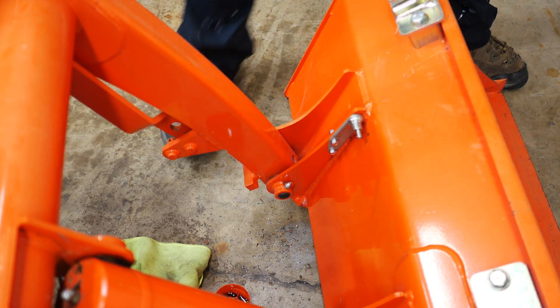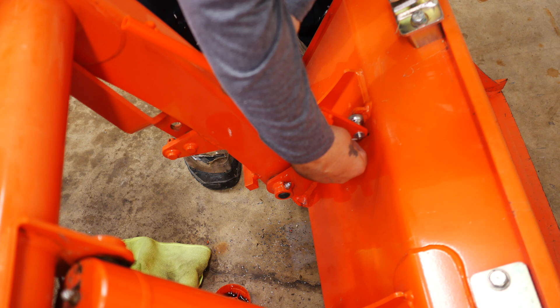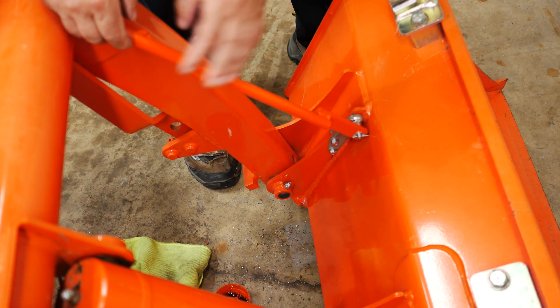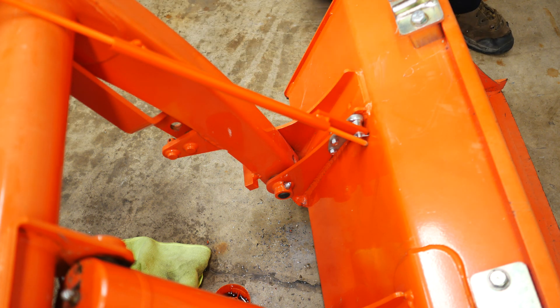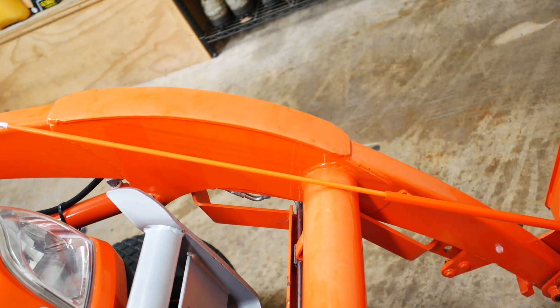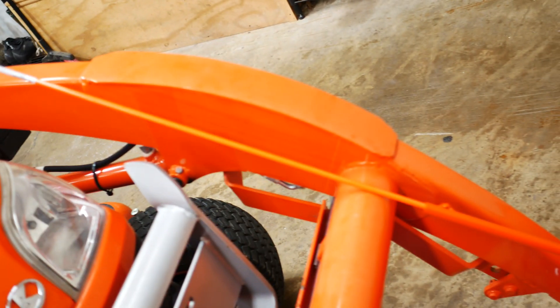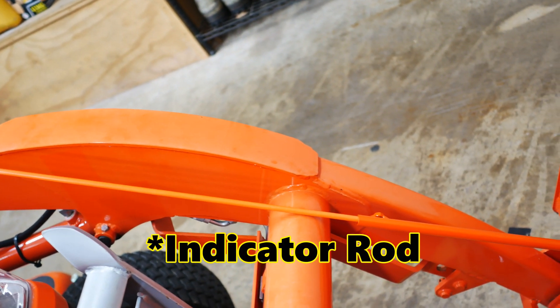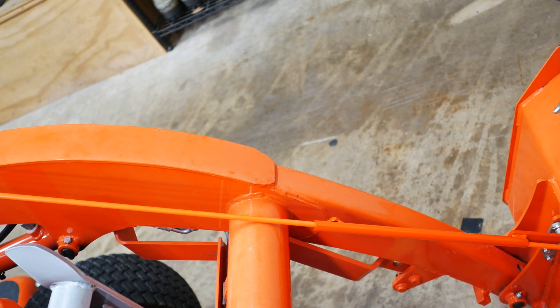Now that I got this ground down a little bit, you can see that it slides right on there. We'll put a washer there for good measure and put the pin in. I'm not going to roll the pin over yet because I'm still in the mock-up phase. If we take this rod and slide it down here, we start to get an idea of how this is going to look. The important thing is that I have enough room there to put an eyelet in to keep that guide rod or indicator rod off this area. I'm going to move the loader up and down a few times to figure out where that eyelet should go, and we'll be right back.